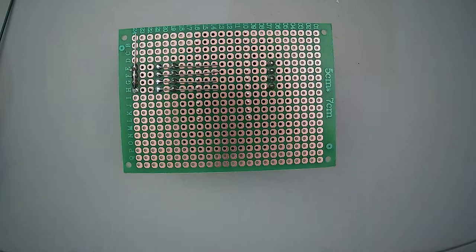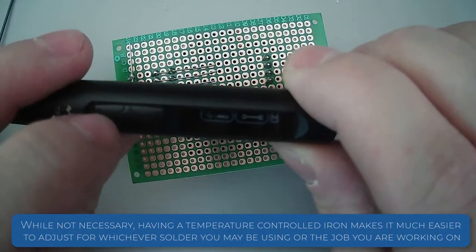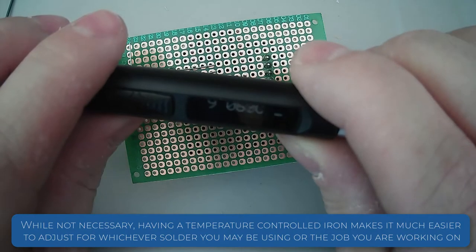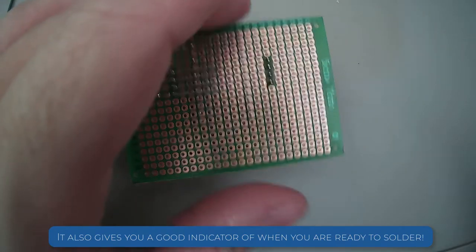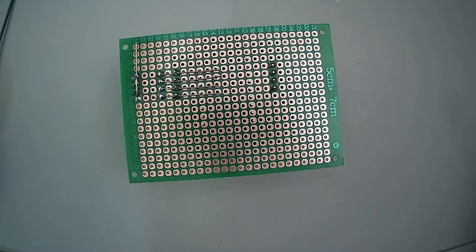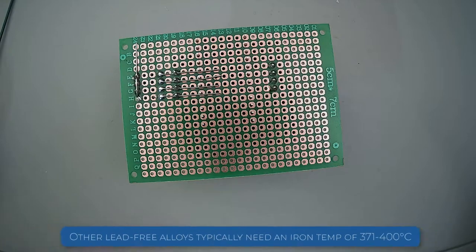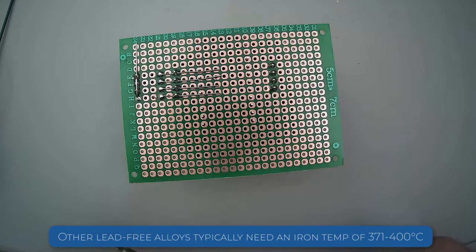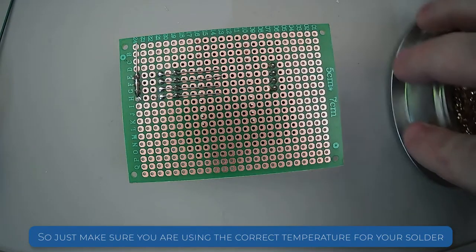soldering iron. And I was talking to my friend, and I actually don't know whether we had the temperature set correctly for this. My soldering iron's not fancy enough to have a temperature. It just is plugged in and on, or unplugged and off. We're just going to go with, it's set to 300. I'll have to adjust it later, but apparently the temperature should be around 315 or so for the solder I have. So we were saying it might be a little low. It's not doing bad. Normally you get dull solder if you're having problems, and I'm not having any problems. The ones that are there look pretty good. So it came out pretty good.